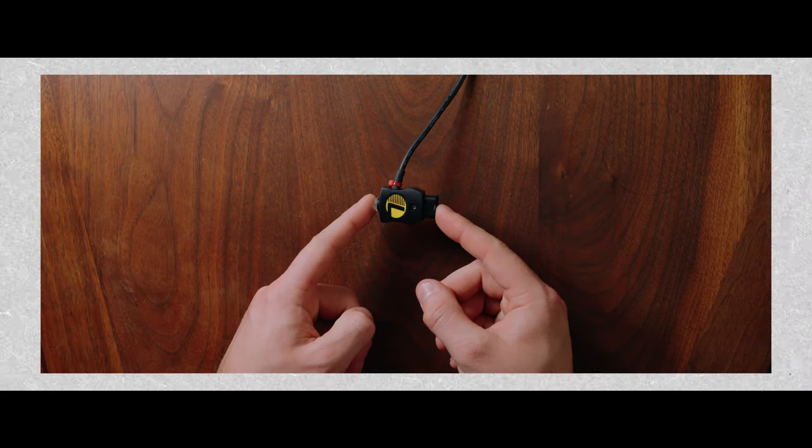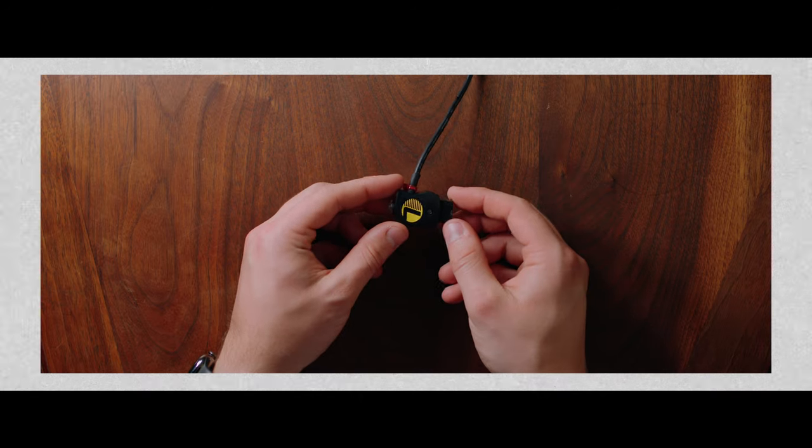Burnt-out SDI ports are a major problem. Most people deal with this by making sure power is plugged in first, which is absolutely the behavior everyone should follow. However, you can't always guarantee that when people you don't know are handling your equipment. The Safe Taps act as a failsafe — they won't let any power through until there is a full connection, making the possibility of an SDI burnout much lower. You do have to solder these on, which isn't ideal, but there are cables that come with them pre-installed. They're not the cheapest, but it's relatively cheap insurance.